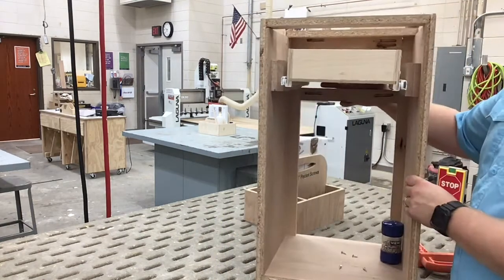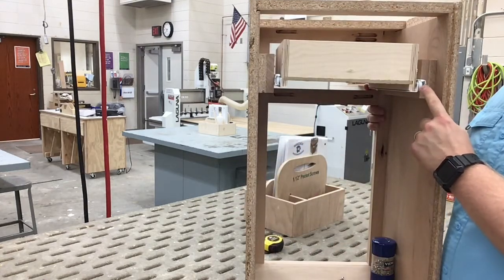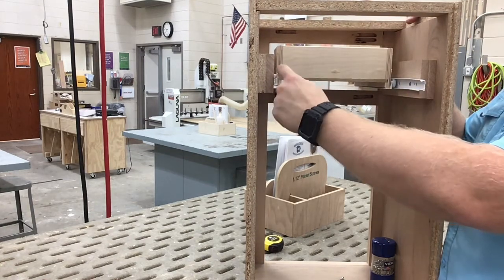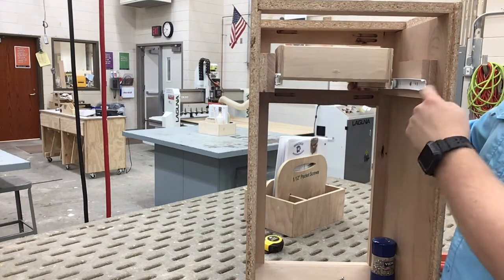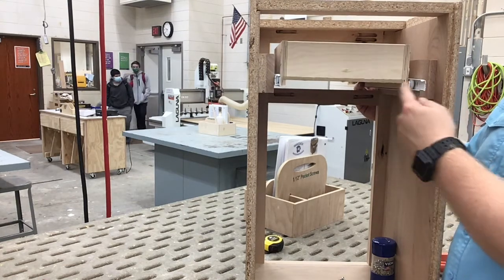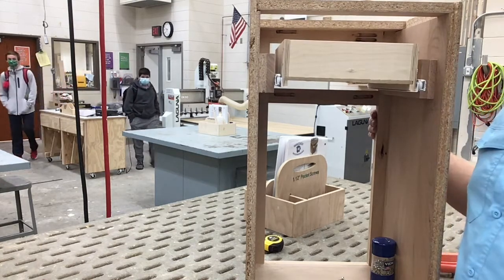If we do a poor job, or if we screw up our buildup a little bit, sometimes this wheel will fall out. Now, we often see people ask about one drawer slide. I don't know if you could tell from where this is at, but this has a curl on it, so it captures the wheel. This one is flat, so the wheel can slide in and out. What that allows is for us to have different thicknesses of our drawer, and we'll be just fine. We'll put our drawer front on tomorrow.